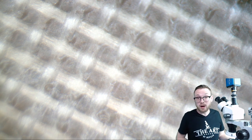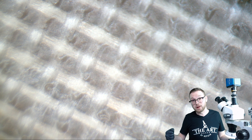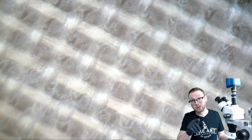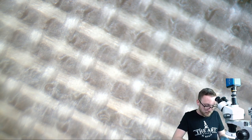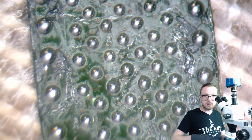And we're going to go ahead and grab our stencil, because the whole point of this is one day you open the refrigerator and your solder paste isn't there. By the way, your solder paste needs to go in the refrigerator and so does your flux. Don't leave them out. They go bad. But anyway, grab your stencil because you're going to use the stencil anyway. And we're going to put this bad boy right here.